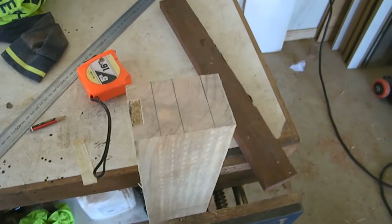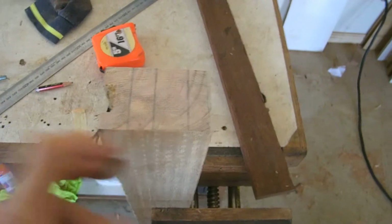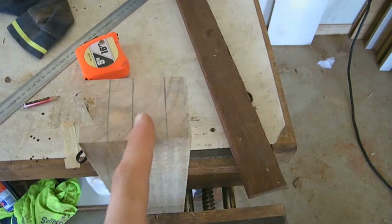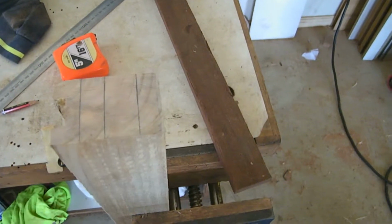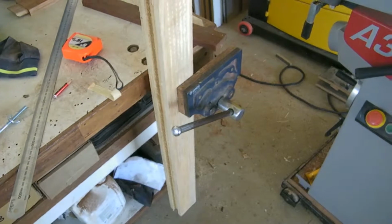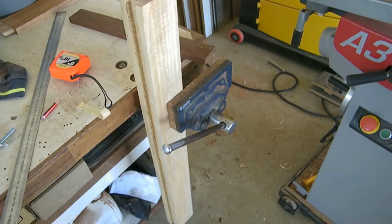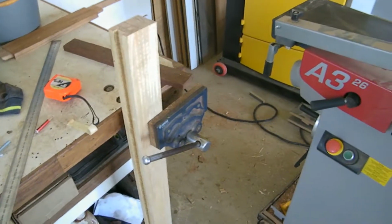This is my plan so far. I'm going to make it up as I go, so I'm going to go 15mm, 20, 15 and have a bolt going through it to tighten it, and I'll have that board out in the centre so it can move up and down, and I'll see how we go. And there are 800 long, probably take them down to 700 once I've finished machining them up square. So I'll machine them up and I'll be back.